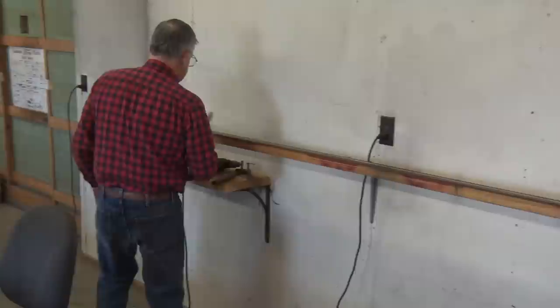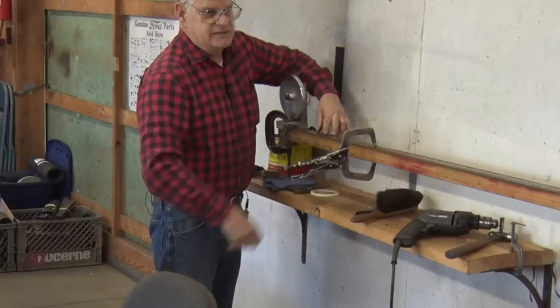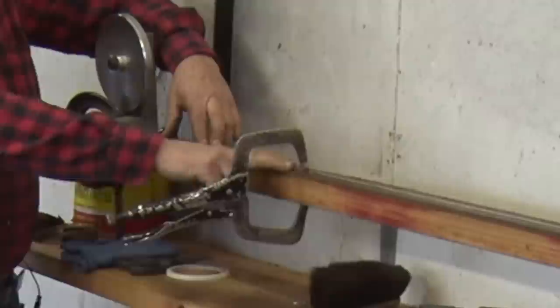Now, in this particular case, I said these are 11 and a half feet long. With all the coils I've done, I know they should come up to about here. It's obvious this one here is short. For either it's one that was done before in the past, or for some reason, since it was new, it was short. So I will make note of that, and I will add a piece to it when I put it on. That way they all have the same number of turns.